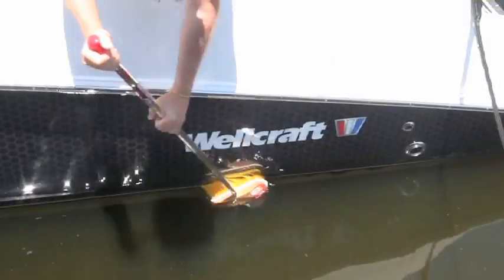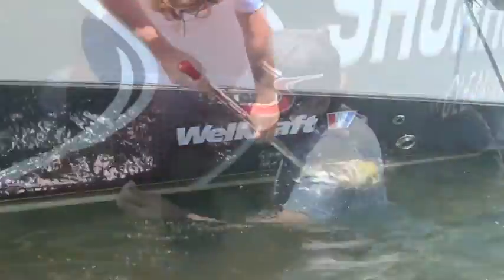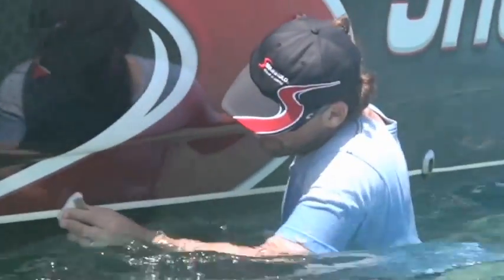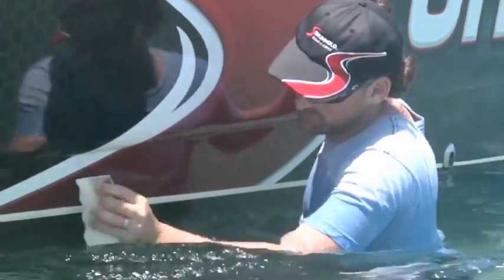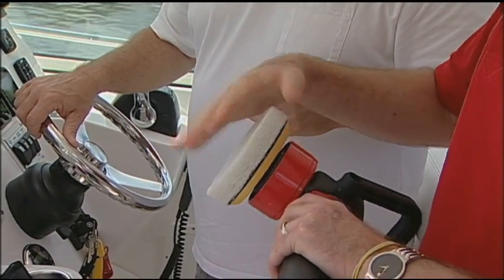How do we remove that from the boat? With any cleaning project, I always recommend let's start simple and gentle and work our way up the aggressive scale. So the easiest — brush, soap, water — attack that water line. If that's not doing it, you work your way up the scale. If you've made it to a point where nothing's doing it when it's in the water, we've got to get a little more aggressive — get the boat out of the water, on the lift, on a trailer. We have some really nice aggressive new pads for the dual action polisher, starting with our Scotch-Brite style Velcro-on pad. This can do the water line. You just hit it with a little serious marine cleaner chemical and work away.